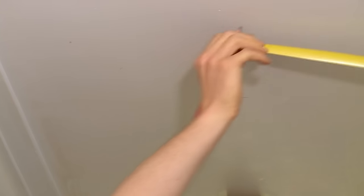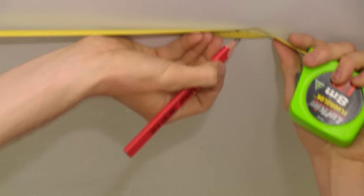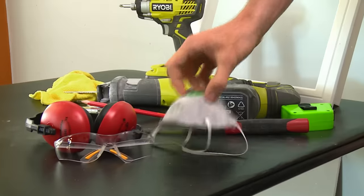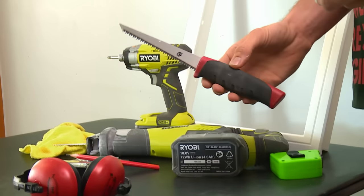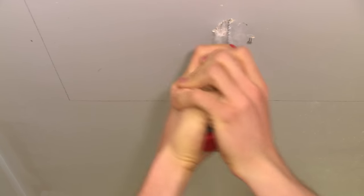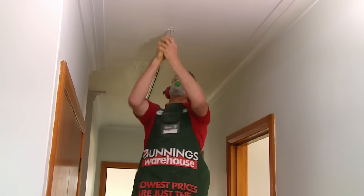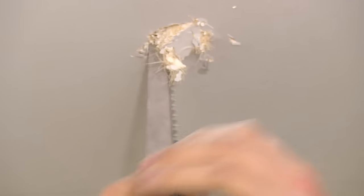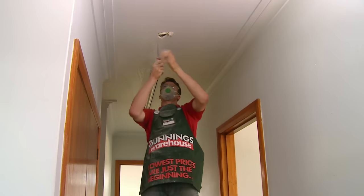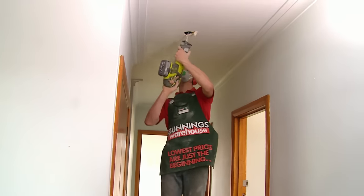I've put a little mark in the middle here and I'm using that to measure from the middle outwards. Next, we're going to grab our PPE and our keyhole saw. We're going to punch a hole in the middle of where we've marked and cut a circle out. Before we cut any holes in the roof, I've sent the tradies up in there to check there's no electrical wires or plumbing that I could accidentally cut into. It doesn't have to be the size of the access panel, just enough to get our reciprocating saw blade in there. Grab your reciprocating saw and slowly cut out the shape of your access panel.